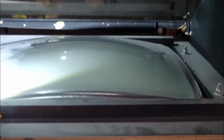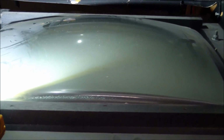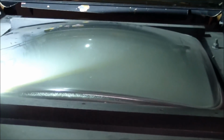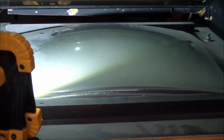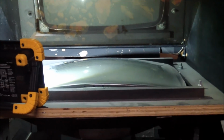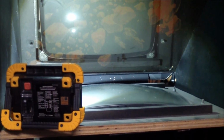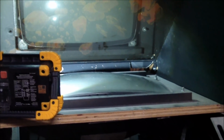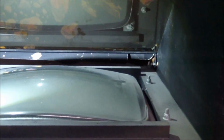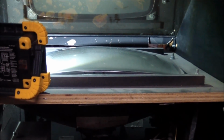Anyway, what mystified me was, so how come this ran correctly on my cocktail? I mean, it wasn't upside down or this or that. Everything looked correct on it. And after looking at the schematics, I discovered that the PCB has two jumper fingers, or let's say a jumper finger and a ground right next to it, which is left open in the upright, so it knows to properly invert the image. But on the cocktail, those two pins are jumpered, and that way the machine knows not to invert when it's not supposed to invert. But anyway, I'm almost there, and a couple more screws and I should be able to slide out the whole monitor shelf and gain access.